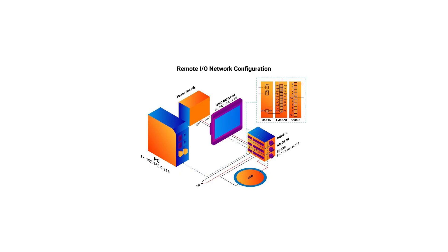Here is a wiring diagram and network configuration for connecting a remote IO to your HMC device. You can also find this on the how-to connect an HMI plus PLC combo with a remote IO via Modbus tutorial page on the Maple Systems website. When you are configuring your Ethernet settings for your PC, your remote IO, and your HMC device, make sure they are on the same subnet.